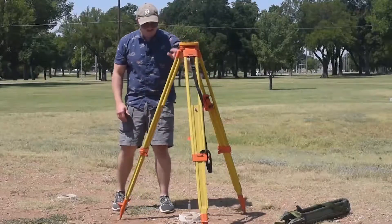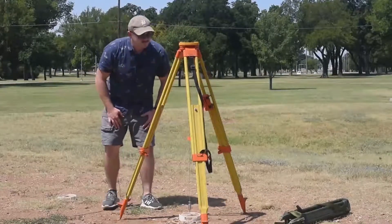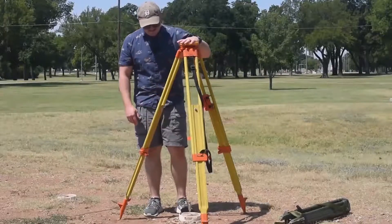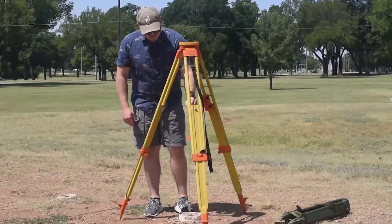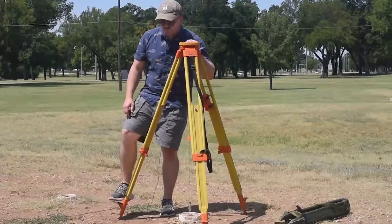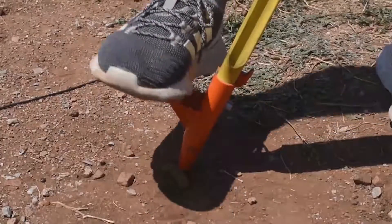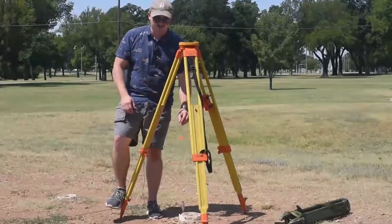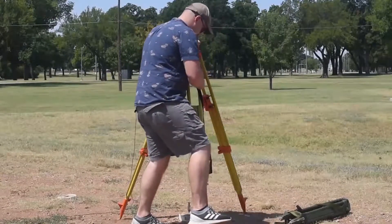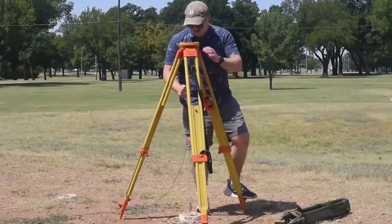Looking at the top of this, I can take a step back and look at it, maybe compare it with the horizon. From all angles it is roughly level — that's good enough. Now I'm going to try to maintain my plumb as best as possible while also stepping on the boots of each leg. Notice as I step on this boot, the plumb bob will slowly move towards that leg that I step on, so I need to step on all of these about the same amount. Step here, there, and then the third one should just be a fine adjustment.